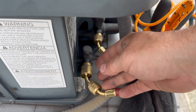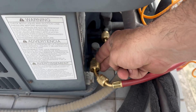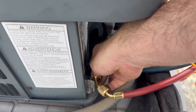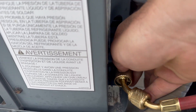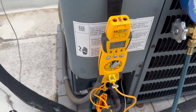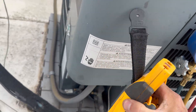When removing a liquid line hose while the unit is running, it's always good practice to wear gloves. If you're not going to wear gloves, keep your fingers out of this area. If your low-loss fittings — if you don't change your seals every year, you're going to get burned, and refrigerant burns suck. Keep your hand and fingers out of that area and you should be fine. I change my low-loss fitting every year, every season. Nothing sucks more than getting burnt with refrigerant.